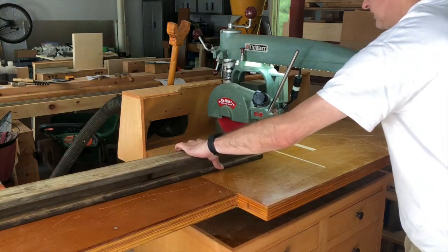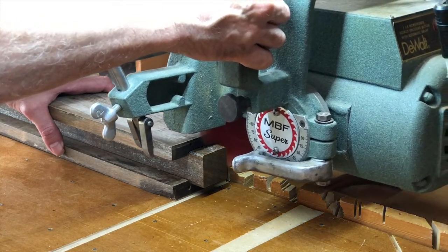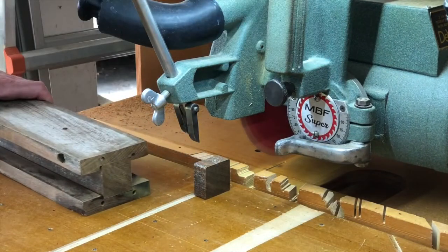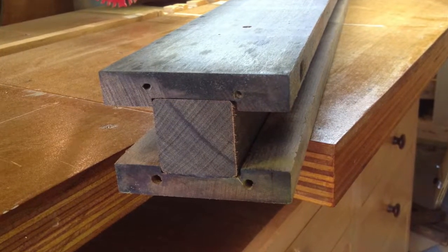The excess wood is trimmed flush with the rails. The laminated rails act as an I-beam and will easily support the handrail without sagging.